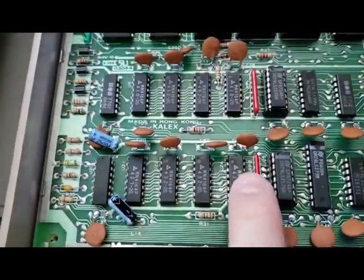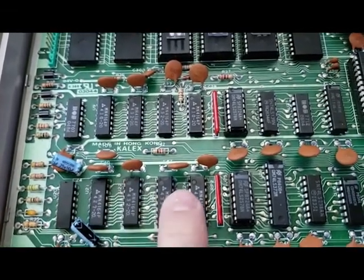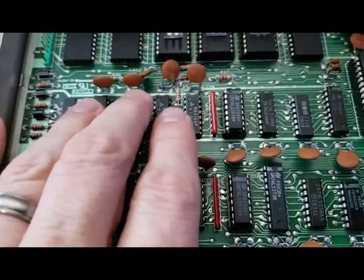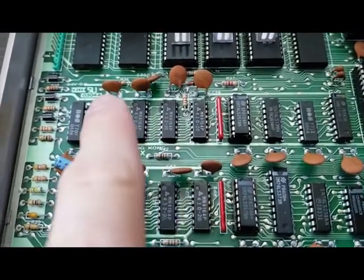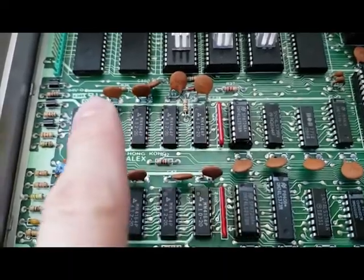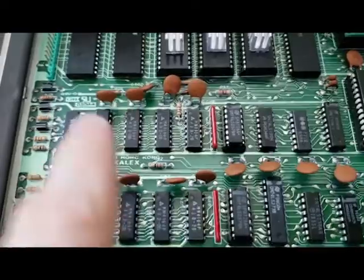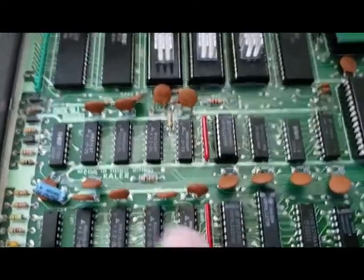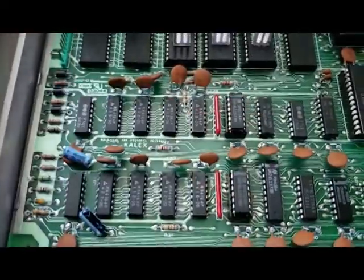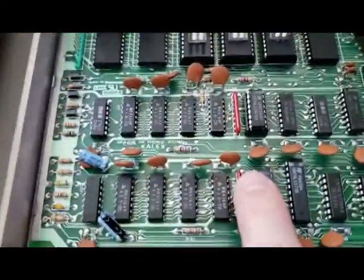So I was looking through here and testing all the RAM to see if any of them feel warm. I've seen those checks done. None of them did. All the connections between them, because these are kind of in series, if you start from one pin and then test across, and I did that on the underside, everything seems to test out between them. Now that doesn't necessarily mean there isn't a problem, but there could be.